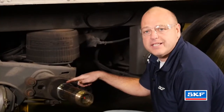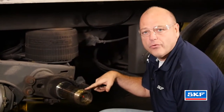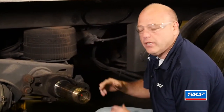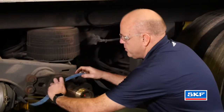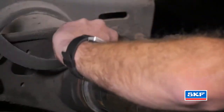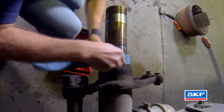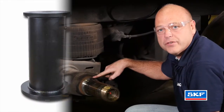After we remove the old wear ring, be sure to clean any sealant off of the shoulder surface. Also inspect the threads, the bearing journals, and clean the shoulder surface with emery cloth if needed. Inspect for any burrs or etching on the seal mating surface.